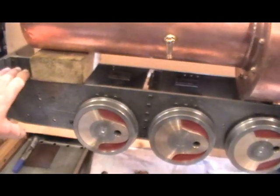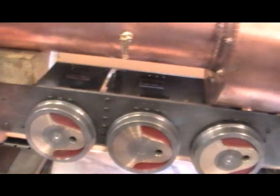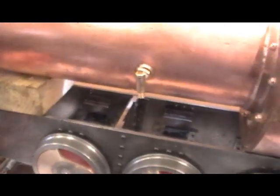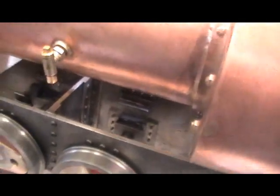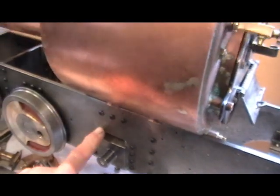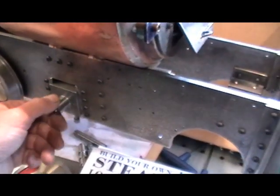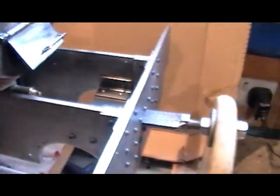That's where the ashes come out. Then I moved on to the frame. I got my frame material from my local engineering firm — it's just black hot-rolled mild steel, so I had to cut it to size and machine all the edges up, which saved me money but involved a little more work. My stretchers: one, two, three under the boiler, four, one on the end here — five — all my stretchers are done. Then I moved on to the horn guides, made all those and fitted them, then did the axle boxes. Got those done, got the buffer beams on the ends.